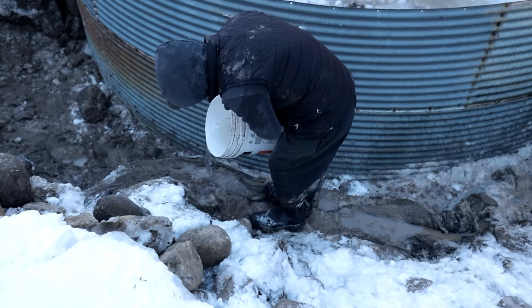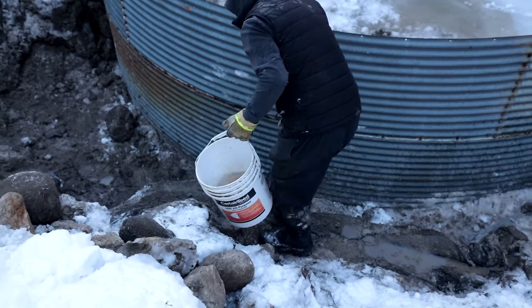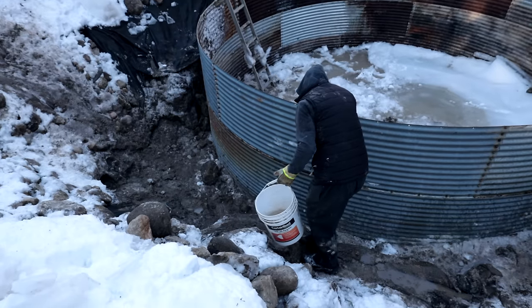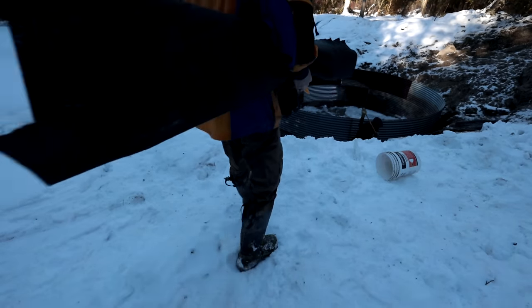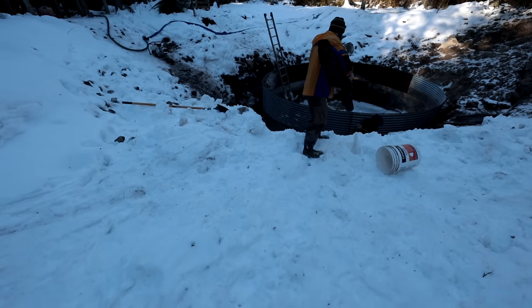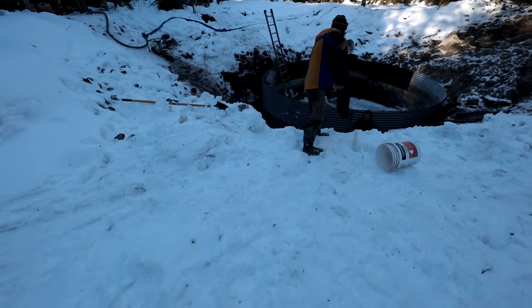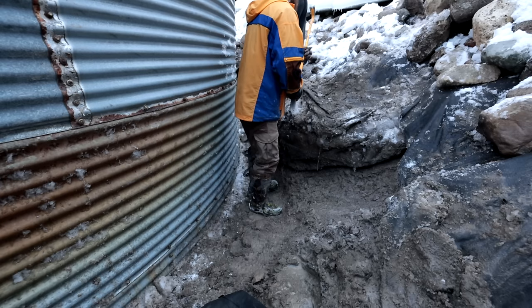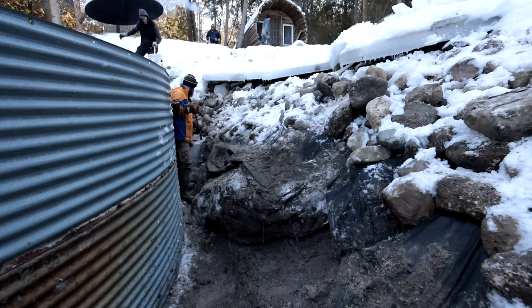So even after exposing the geotextile, we realized, of course, that it wasn't so easy just to tie it back in. Even running water with the pump, you just draw frozen water over top of the geotextile, it doesn't melt it enough. It'll kind of expose it a little bit, but freezing cold water on top just wasn't cutting it. So we used a little bit of warm water. It kind of got the job done, and the more you step on the clay, the more it gets mucky and the more it kind of frees up. But we really wanted to get the tie back pretty well perfect.